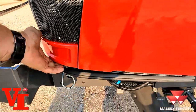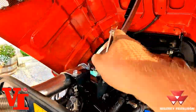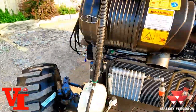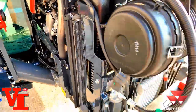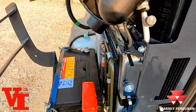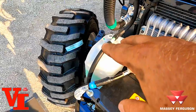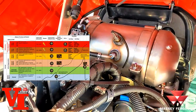It's easy to get into and maintain — just pull that lever, pull up the hood. It's even got a gas strut there that'll hold it up. You have your clean-out screen here on this side, another clean-out screen on the front, and a rear clean-out screen to keep grass and stuff out of your condensers and coolers — those are made out of metal. You've got your battery, coolant overflow, and air cleaner all right here handy.